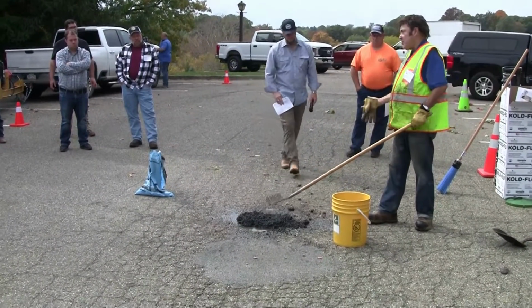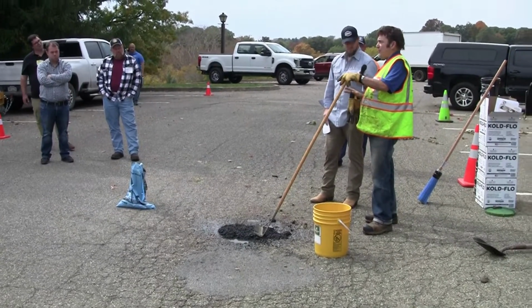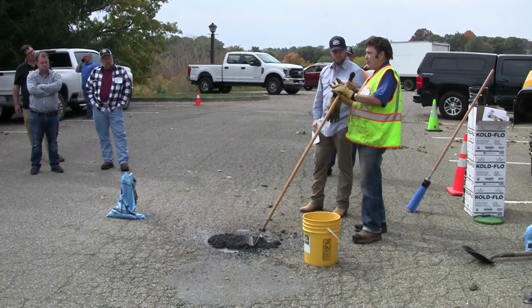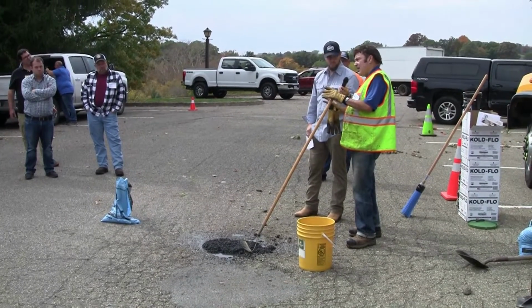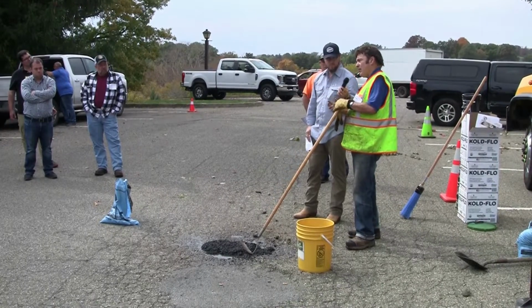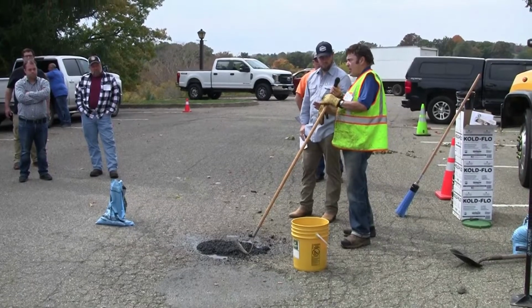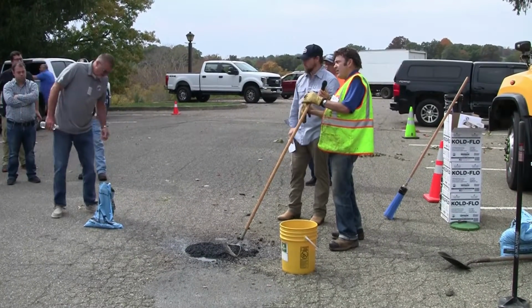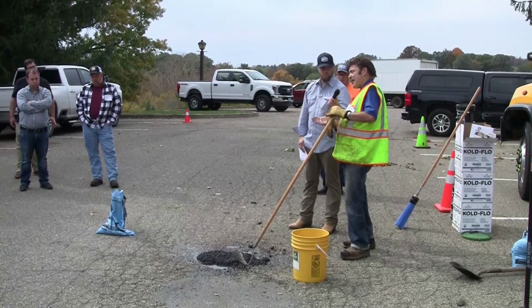Again, this mix is a winter mix. It's geared for minus 15 degrees up to about 50 degree workability. Then we make a mix from 50 to about 80, and then we make a summer mix for 80 and above. Having a good material will change the viscosity, just like you do with oil in the winter. You've got to have a material that the person can handle, it's got to be workable.